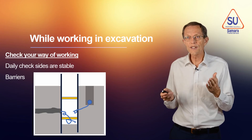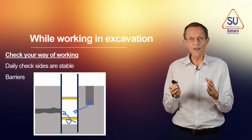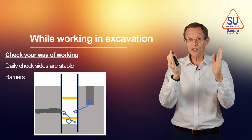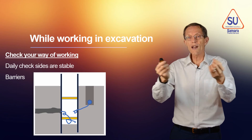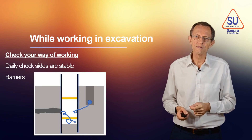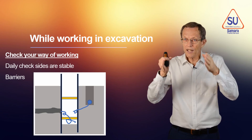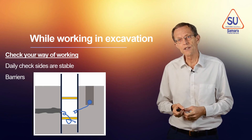While you're working in the hole, keep alert. The excavation may be open for a few hours or a few weeks — check it every day because things can happen. The trench sheets could move, so check the support. Check that the barriers, signs, and fencing around the excavation are still in place to protect the public. The ground may leak water into the excavation, making it less safe. Or there may be gas leaking — perhaps your excavation disturbed a nearby cracked pipe and gas is coming in. You need to think about these things.